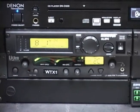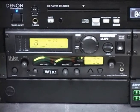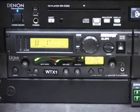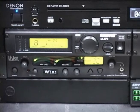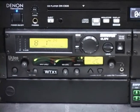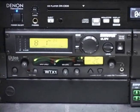There are two LED meters stacked on top of each other which represent the two input channels. If these meters are lighting up the red section of LEDs, use the input knob located to the left of the meters to turn up or down the level of the signal.